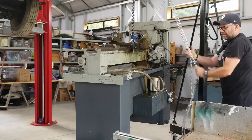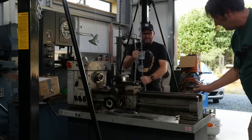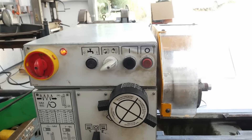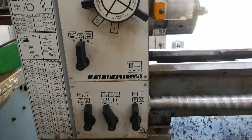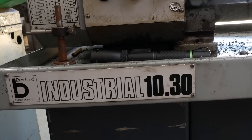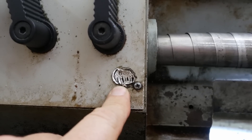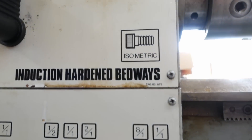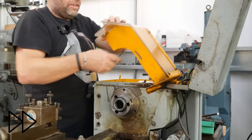A convenience item that's nice to have. There's a threading gearbox with a nice wide range of speeds and threads. Take this off before one of us runs the carriage into it. So this is what, 1982? Yeah, I reckon. Boxford Industrial 1030 lathe - that's a 10 inch swing with a 30 inch bed, which is kind of the extended length bed version. According to the decal it's got a 6 millimeter lead screw, making it a metric lathe.